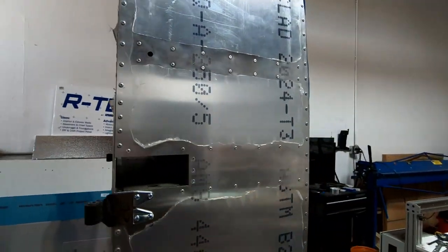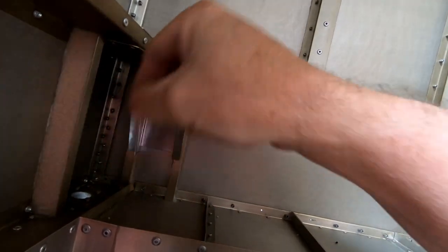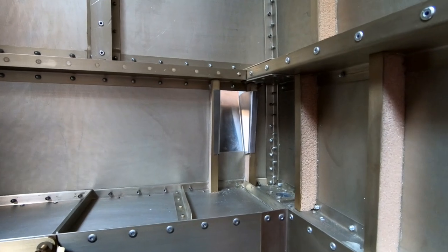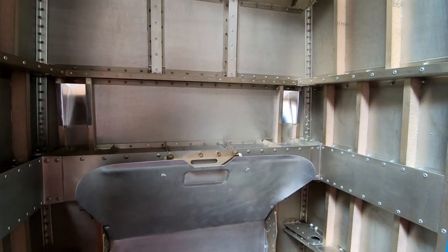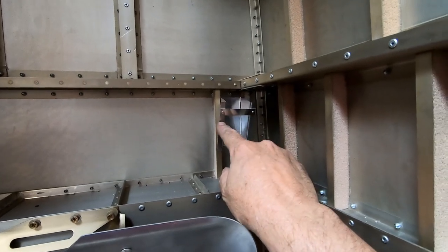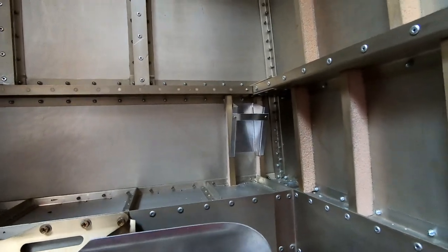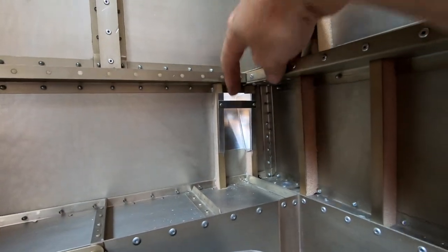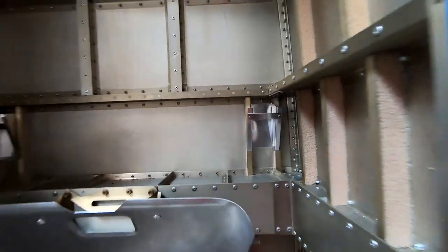A small T-handle strip needs to be riveted across the front of each vent to strengthen it and provide a finger grip for opening and closing. The strip was cut and attached with a countersunk solid rivet from the bottom for a flush fit — neater than the pop rivet specified in the plans and slightly shorter. The vents function as intended and the curved end prevents the vent from pulling far enough to disengage from the slot.